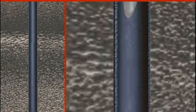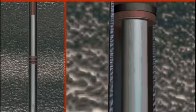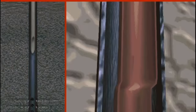The decision to complete the well, implemented by setting and cementing the casing, is followed by running the tubing string. An engineering prognosis is then completed. This specifies where the packer, side pocket mandrels, and any other downhole production equipment are to be placed in the well. The side pocket mandrels are preloaded and hydro-tested with dummy valves in the pockets. The packer is set somewhere above the perforations to the productive formation.